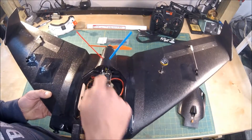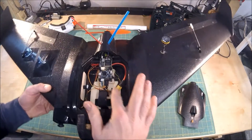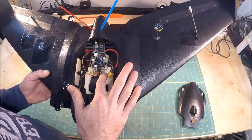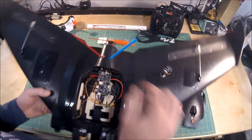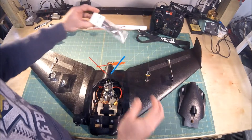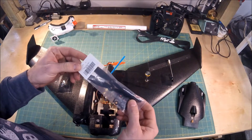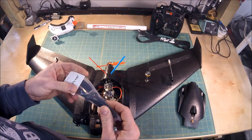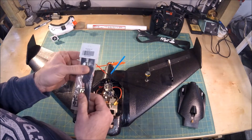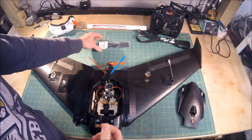I really like this ESC. I currently have the 5 volt BEC output not running to anything, so I don't run it back into the flight controller — I depinned that and covered it up. That's pushing my Emax motor. I've got HQ props — the HQ direct drive props. I really like these props; I've used them on other planes and they're nice and durable and efficient. I'm actually running it in reverse with the way the motor is set up.